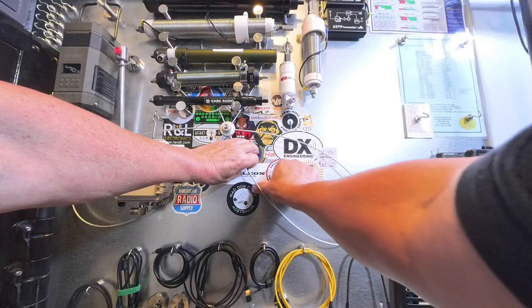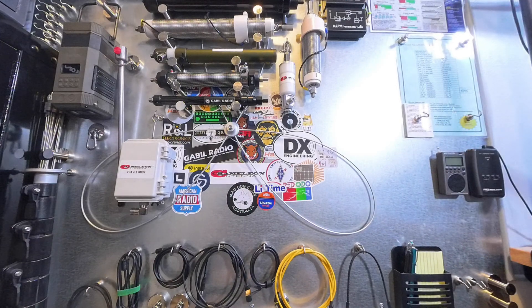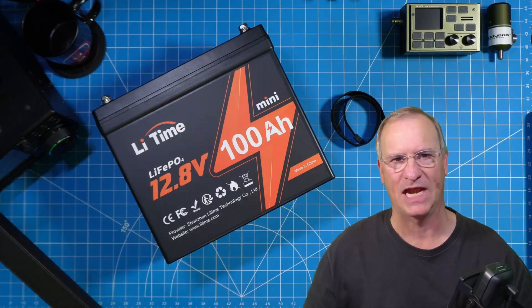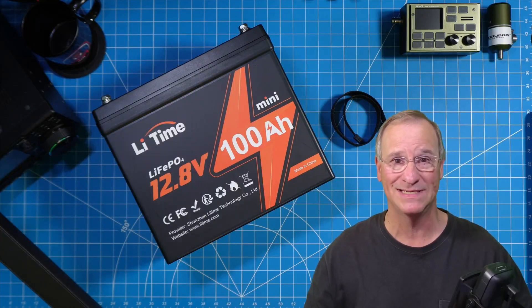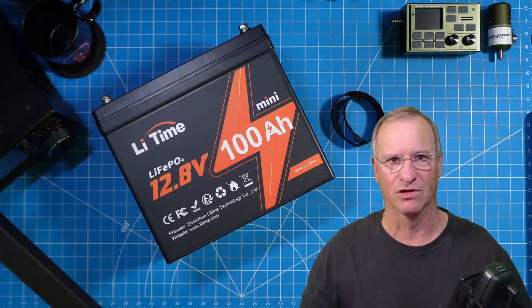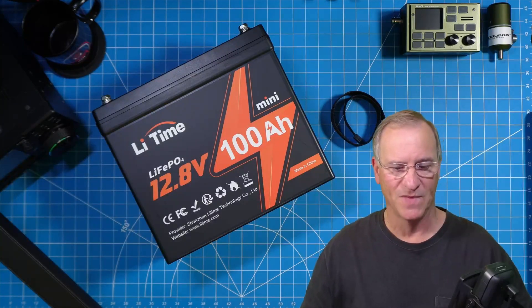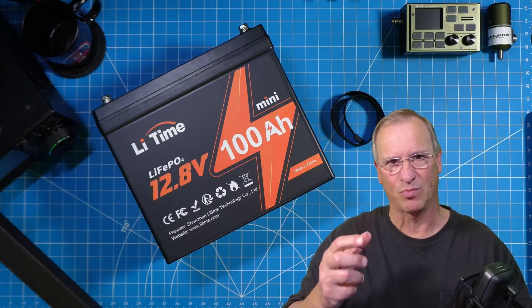We have a mini battery — mini in size, but how about mini in capacity? The rated capacity is 100 amp hours, and it came in at 103.171 amp hours. We met and exceeded the rated capacity — that is a pass. You do see a couple of blips on the chart; I was moving the CBA5 and battery around on my workstation during the 10-plus hour test, and that caused those blips — that was all on me. When I don't touch my batteries, those blips don't show up on my graph, which tells you how sensitive and precise this testing equipment is.